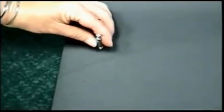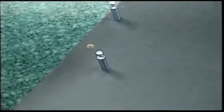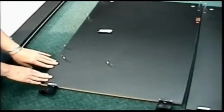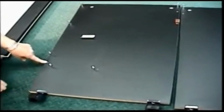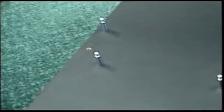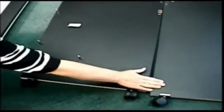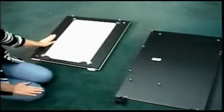The next step after installing the cams is to put the connecting bolts into the panels. They simply screw in place in the pre-drilled hole. I just installed one on panel D. D, and C both, have six connecting bolts. The additional hole on the side is for your wooden dowel. So we've used 12 connecting bolts on panels C and D. The last four are installed on top A and B.